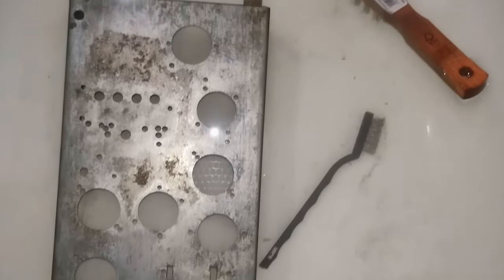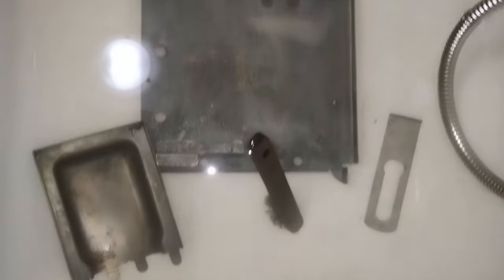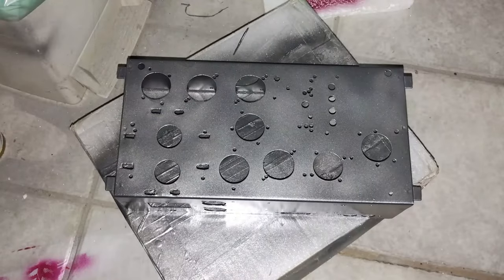After a couple of days, the parts were extracted from the acid and soaked in water to get rid of the acid residues and were cleaned using brass brushes, removing the paint and the rust. Each piece was dried and immediately sprayed with a zinc paint.